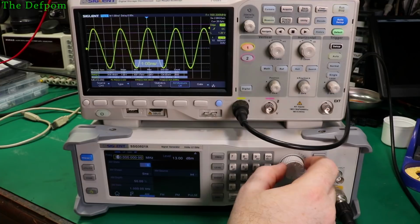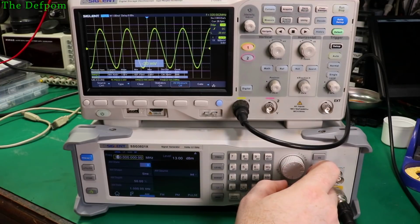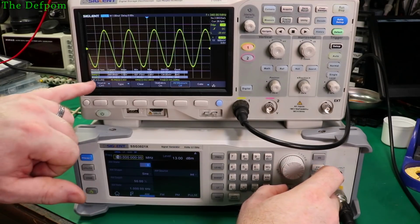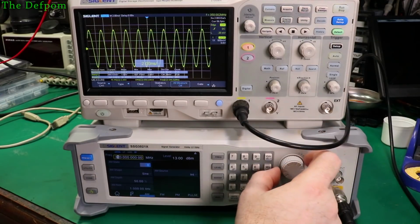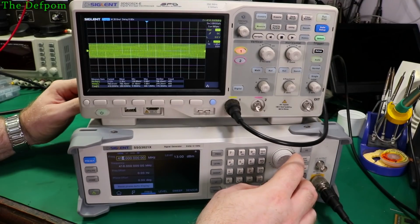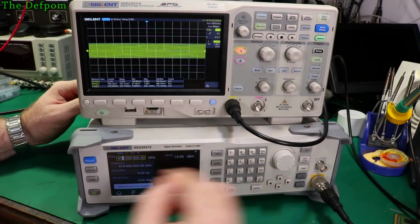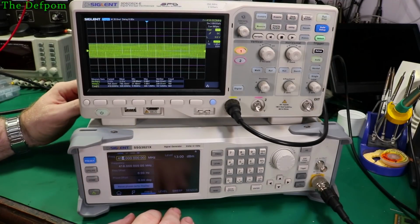Let's go some more. I'll shove my trigger point in the middle. Okay, so 350 megahertz is 0.86 volts. So that is actually exceeding spec already. So 0.707 is, let's call it there, shall we? That's 418 megahertz. So 418 megahertz is the 3 dB point, thereabouts, which means it's got near enough 420 megahertz bandwidth, not 350. So it meets the spec, easily meets the spec.